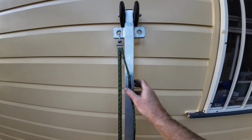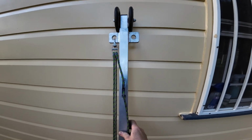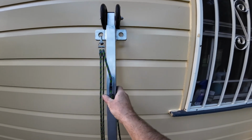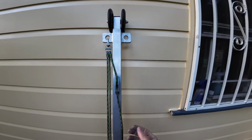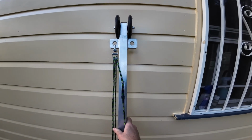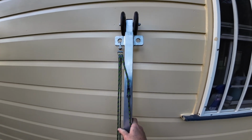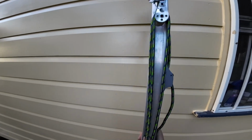We find that if the mast doesn't sit in the mast foot well, like we can't get the pin through, we can just use these side ropes and pull on them, and that will pull the stand to either side and give us that small amount of movement we need to get the pin in. It's usually not much, and sometimes we get lucky and it just goes straight in, and we can cheer and quickly move on. Other times we've been there for a couple of minutes trying to figure out which way to go is more the problem rather than how far to go. You can't quite see with the pin which side to go to.